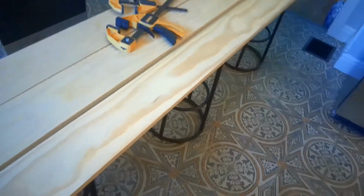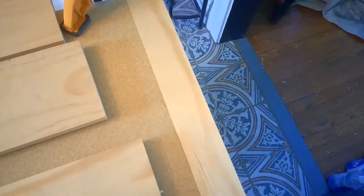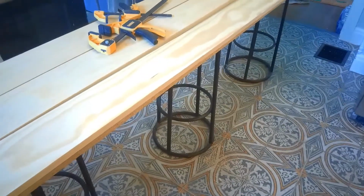All right, getting set to make the countertop, which is going to be 99 7/8 long and approximately 18 inches deep. I got an 8-foot sheet of particle board ripped down to 16.5 because there's going to be a border on the front. Had to pocket hole in a 2-inch piece at the end here because it came up short. And what I'm going to do is something I wouldn't normally do, but I'm just going to put a bunch of glue on top of the particle board and then screw from underneath to tighten it in.